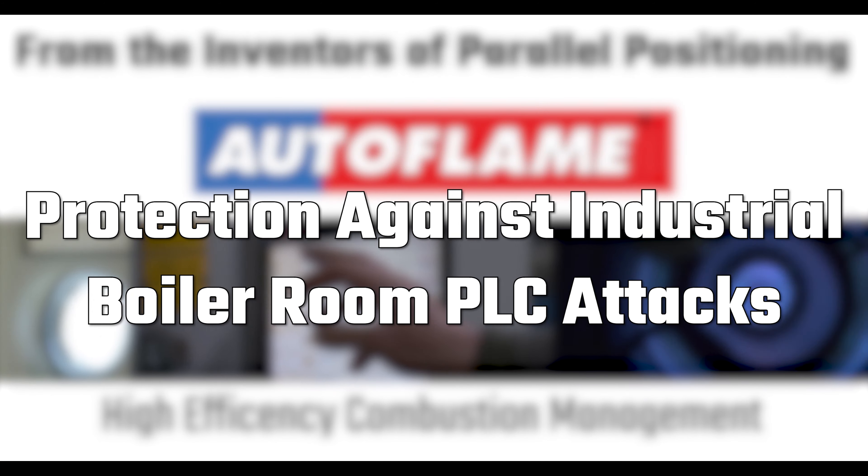We can look at our gas pressure — here we can see our commissioned value and the upper and lower limits. By pressing the history button I can look at the last 24 hours of information on both the commissioned and actual values, and zoom in on a specific point in time. Here my commission value is shown and underneath is my actual gas pressure. If I ever get a problem with my regulator, it's very easy to see if the regulator is hanging up or we're getting a droop. Right here we're actually very close — almost within one inch of our commission value.